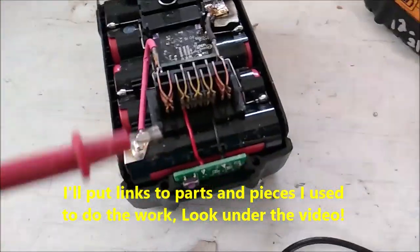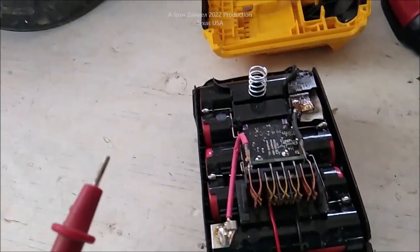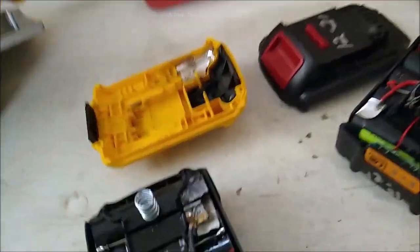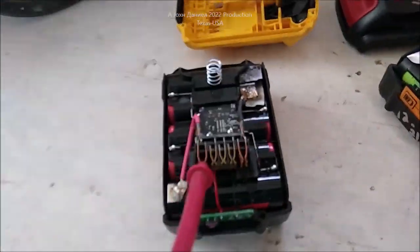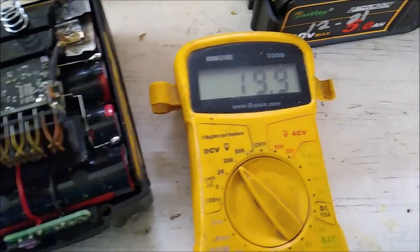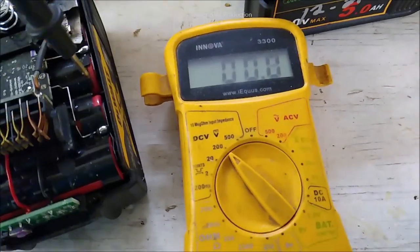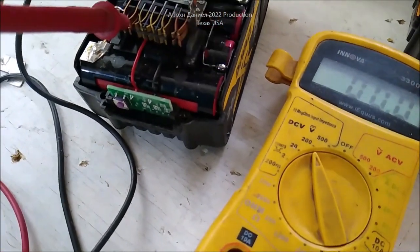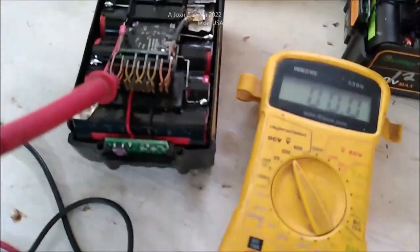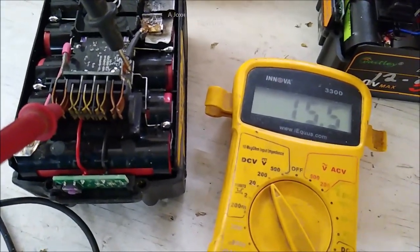These are Panasonic cells; it's funny — these batteries come with different cells. Some are Sanyos, some Panasonics, and I think that one over there is Nathong or whatever. Now I'll put a probe back to the battery's actual terminals and get a reading: 19.9 volts. But coming over to where it should also read, it's only picking up voltage through the BMS balancers. The balancers are the only thing feeding power in — they feed through this forward set — and balancers alone won't give you any amperage.